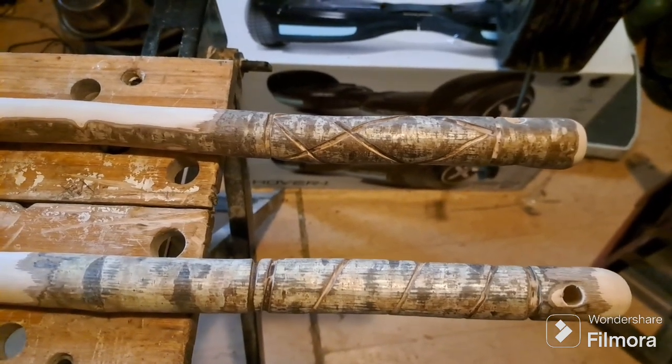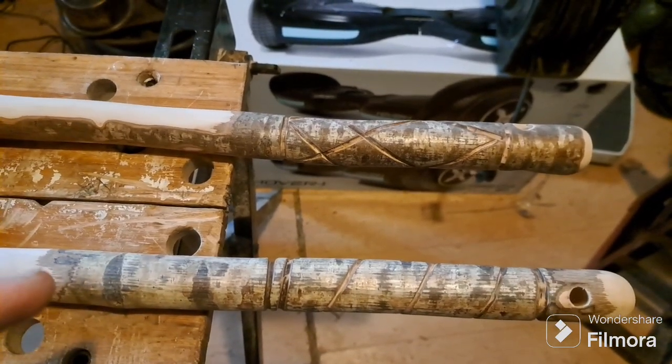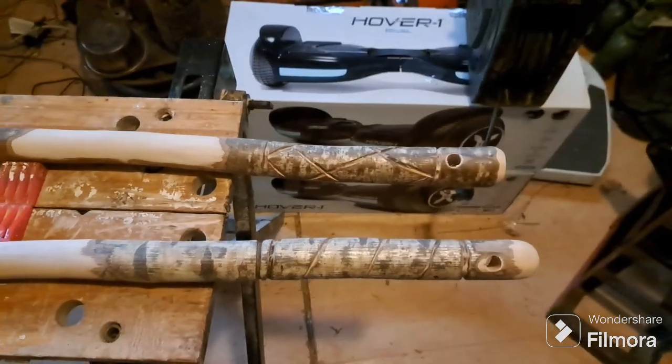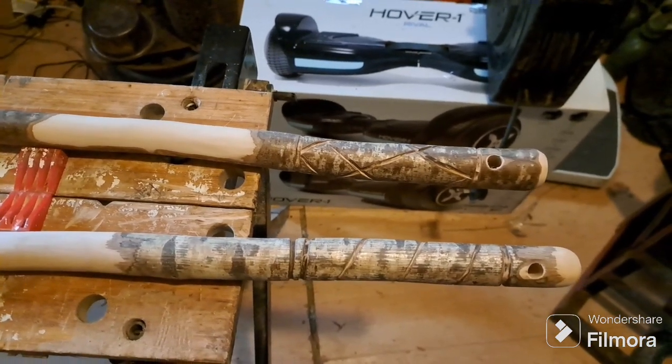There are the two hand grips that I've carved into these hiking sticks. I've got the diamond one there and the swirl one there with a couple of end caps on the bottom. It hasn't come out too bad. You can see what they are, so yeah, I'm very happy with those — you can do them quite easily. I've sanded them and they're ready now for wood burning. If you have a stripped stick it obviously becomes more visible. They're all sanded back, ready for wood burning, and then I'll put the finishing coats — some will be a varnish and some will be an oiled finish.